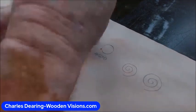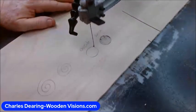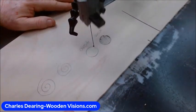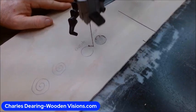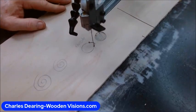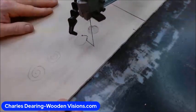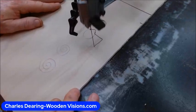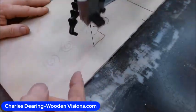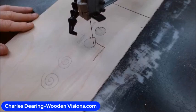For a veining cut I'll go right down the middle, and we'll do the same thing on the outside cut. Now the outside of this circle is going to be the waste area, so same method — taking in mind that the outside area of the circle is the waste area, so you've got room to play with. If you feel confident, cut right up against the line; if you're coming in from out here and want to go slightly shy of that line, you can slowly come into it and just nibble away at that line. A lot of beginners seem shaky because they feel obligated with the saw going fast to cut as fast as it's cutting, but you don't have to.